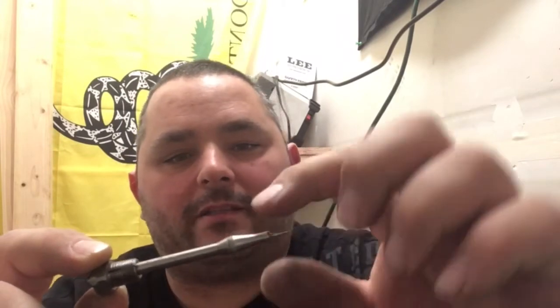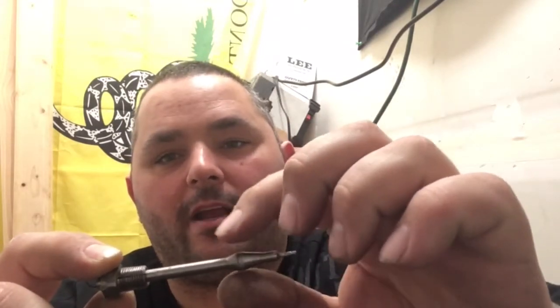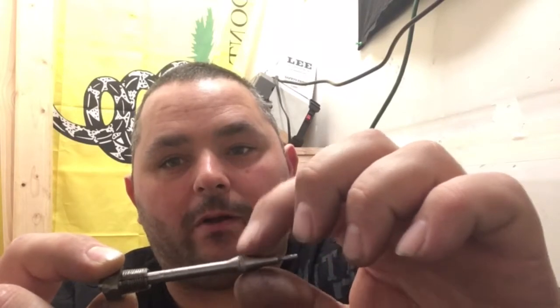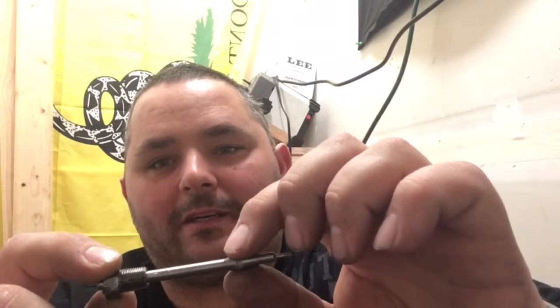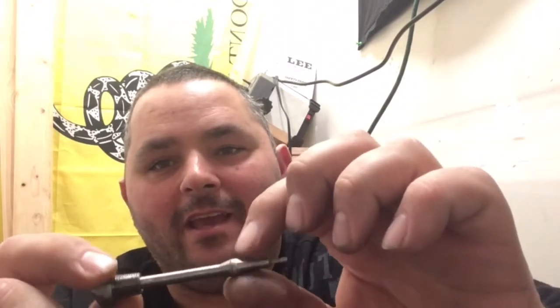The other reason is you tend to get a lot of burrs building up right here — these are brass burrs that broke off the brass. Once they start building up, they begin denting the neck of the case, and it also looks like it has worn this pin a bit. I contacted Lee and got a brand new pin, so I'm not really concerned about the wear. Case conversion can be hard on your die, so be prepared for that. You might even want to buy an extra resizing die — one for conversion and one for reloading.